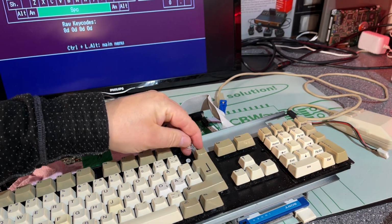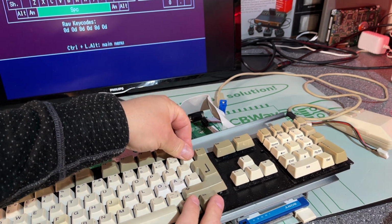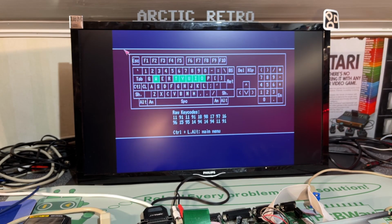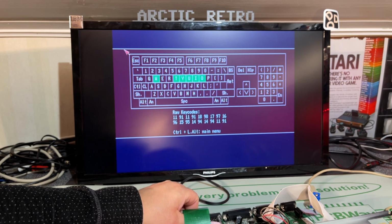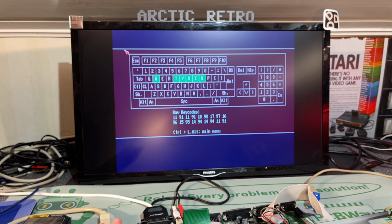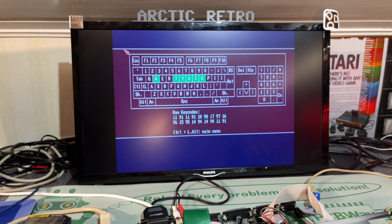Here's a new key. I took this from an Amiga 500. And that fits perfectly. Well, since one whole row of keys is not working, it indicates some break in some of the lines that go to the computer. I tried to wiggle the cable a little bit, but it doesn't work. Anyway, I'm gonna take this keyboard apart now and clean it up, see if we can find out what the problem is, and take it from there.